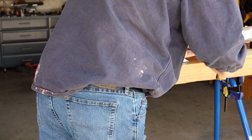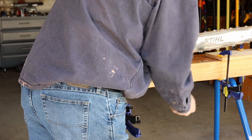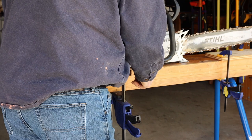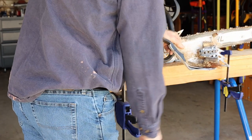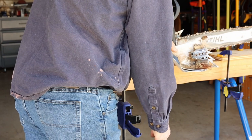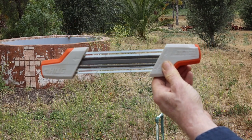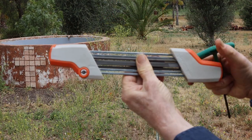I'm taking off the two nuts that hold on the sprocket cover. Fiber collects under the cover and can interfere with the oil delivery. This isn't too bad for one tank of gas. This is the Stihl 2-in-1 chain file. It files the chisel points and files down the depth guides at the same time. Note the correct direction arrow — the file cuts on the push stroke. There are right-handed and left-handed teeth.